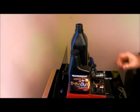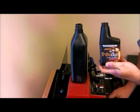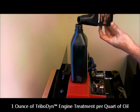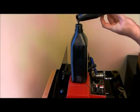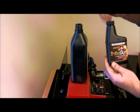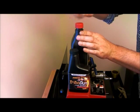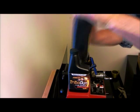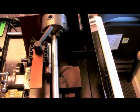Seize. Before testing the Tribodyne, we took the Tribodyne additive, poured out one ounce into the quart of the motor oil being used, gave it a good shake to make sure it was thoroughly mixed, and it was now ready for the test. Tribodyne is a dark gray colored additive, and when added to your oil, will turn it a dark gray color.